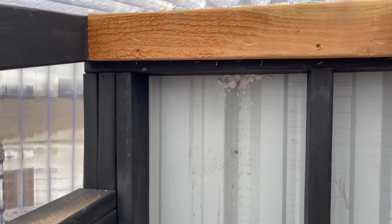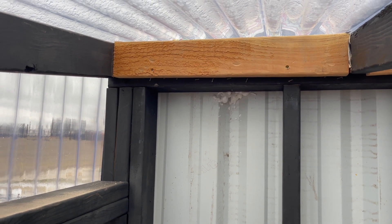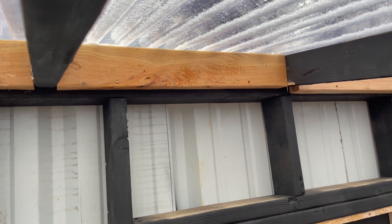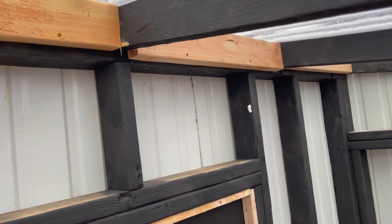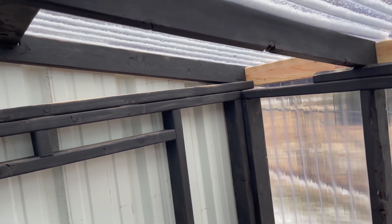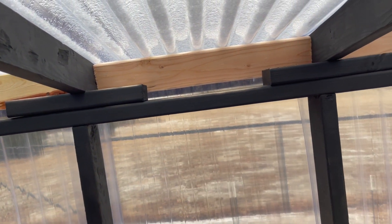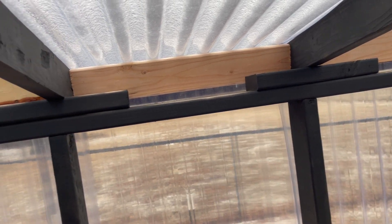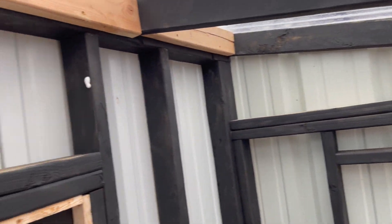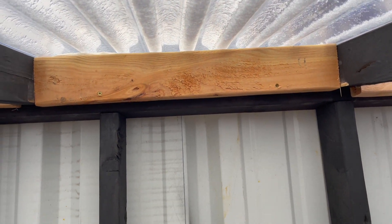Let me show you. Right up here you can see where I put the 2x4 — there was a big gap right between the corrugated plastic vinyl and basically the 2x4 of the frame. All I did was cut 2x4s to the perfect length in between the running 2x4s on the roof and put them all the way down, and it has now cut out the draft. I also added them to the back side on the outside because it had these 2x4 spacers and I couldn't get a good seal. Everything is fairly sealed up, and there's just a little bit of airflow through the corrugated — I'm gonna call that ventilation.